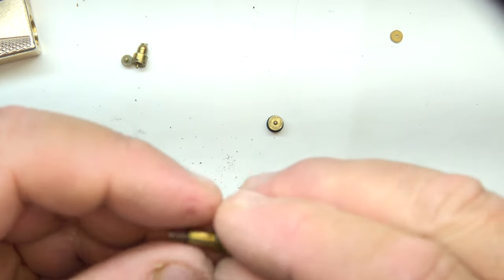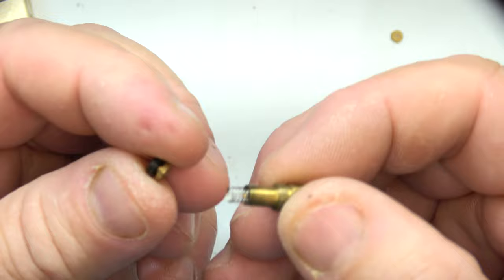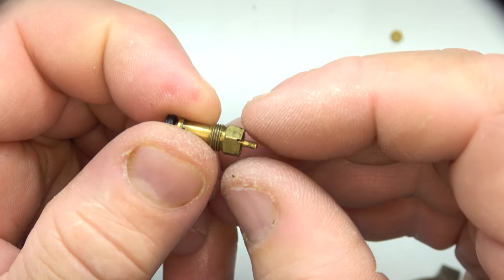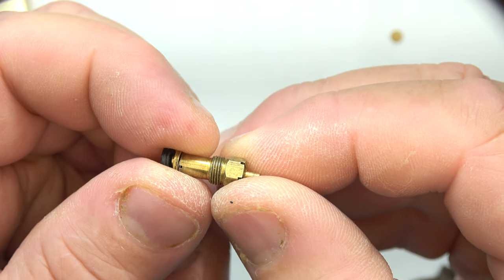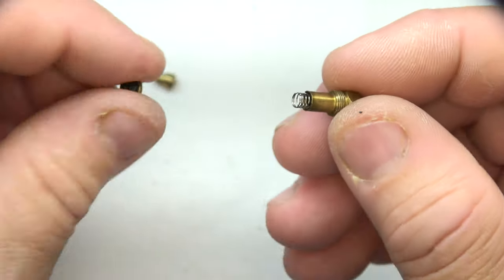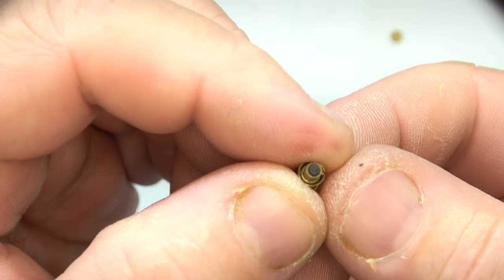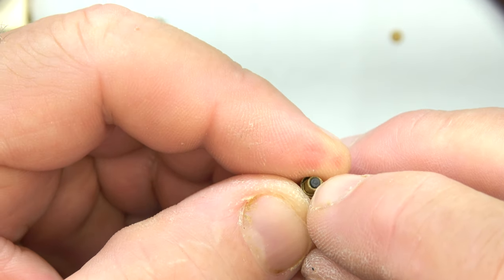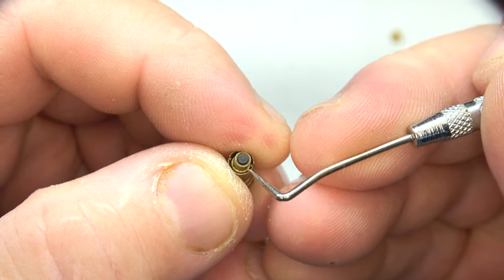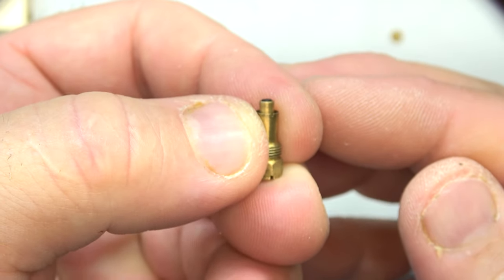Now another thing to talk about — this is the main part on top. See this little orifice in here? That's your hole. This is the part that when you screw your flame adjuster, it turns and goes up and down in your lighter and pushes on this part here, which compresses your sponge. Now if you take this spring off and look down in there, there's a little stopper. Sometimes when you take your lighter apart, this will have a dimple in it from sitting there for a long time. What you can do is take your little pick, pick that out, turn it around upside down, and you'll have a fresh side on the stopper.